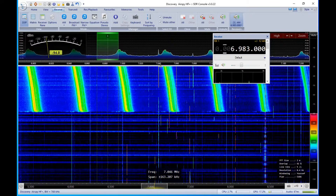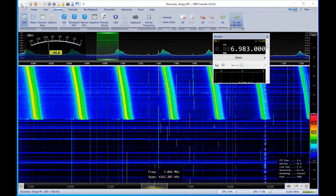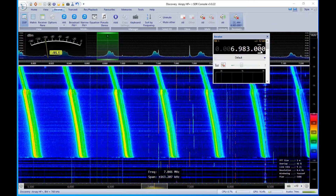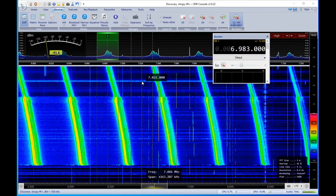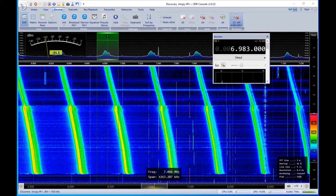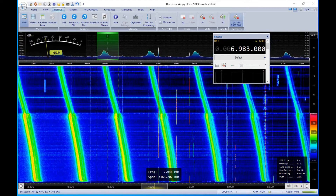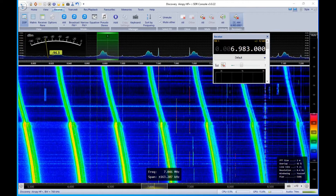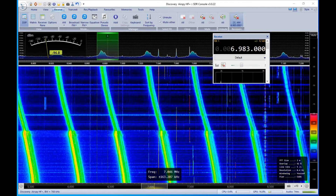I inserted one component - that little two series chokes on the common core, not a transformer - and look at what happened to the noise floor in between and the actual carrier power. That's just one of the components that should have been designed into this on the input side. There's also a filter on the output side, so this power supply could be made quiet if all the right components were installed, but to save a couple of bucks they didn't. Thanks a lot for checking this out - hit the subscribe button if you can. This is W1VLF signing off.